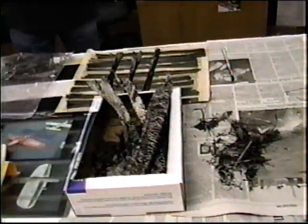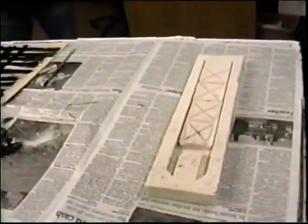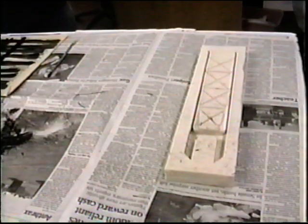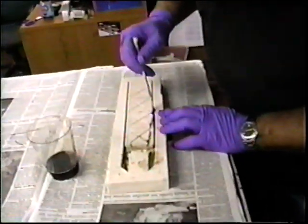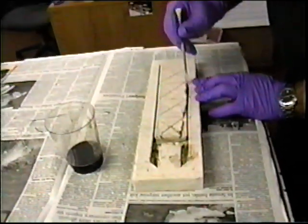It's much thicker than thin stuff, so you'll be able to just pack it in. The idea is to get as much carbon and as little resin into that mold and then have it dry overnight. So first step is you just paint away. Get a coat on it, even though it's not going to stick. See, the original coat is going to all fisheye up like it's doing here, but just get it wet anyway.